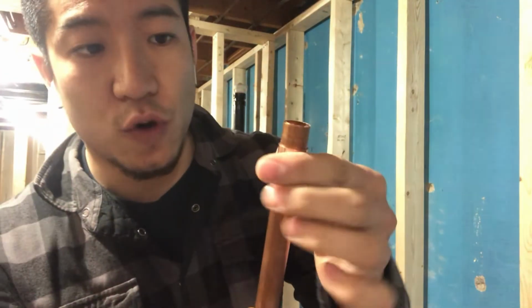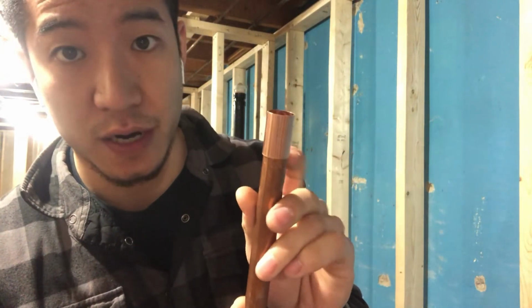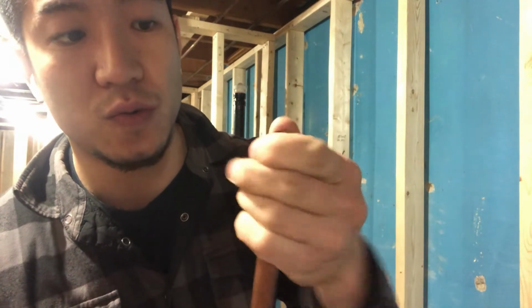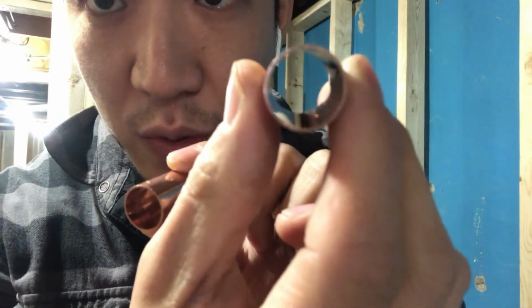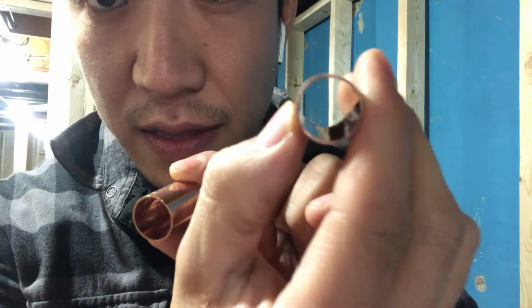So when I do the cut, I'm going to slide this over the existing pipe and then fit it back normal, so I actually have the room to do the solder. So all I had to do was grind out the middle parts. So in the comparison, you see this one, it's smooth, whereas this one, it has the 2 notches in it.